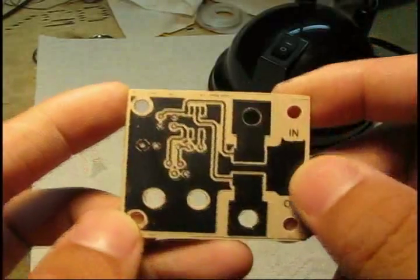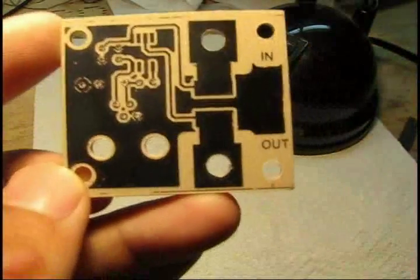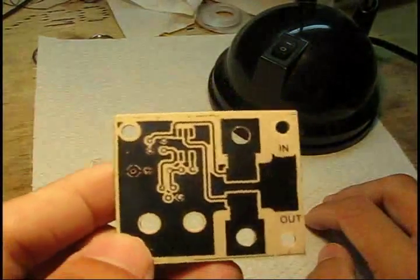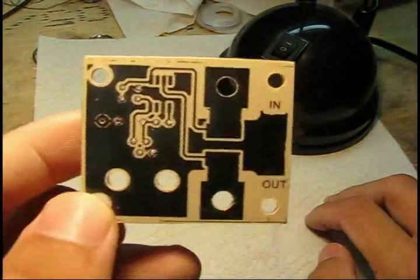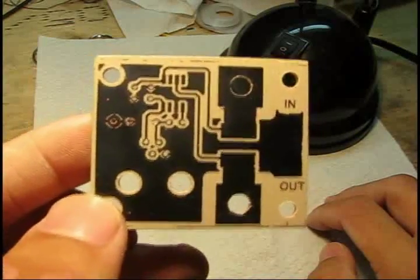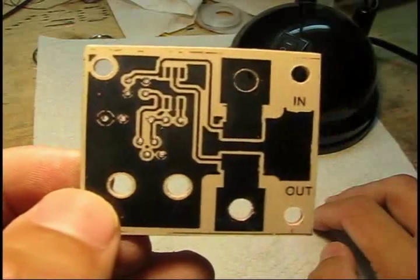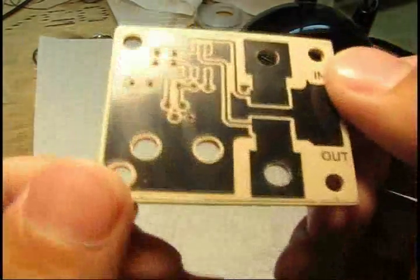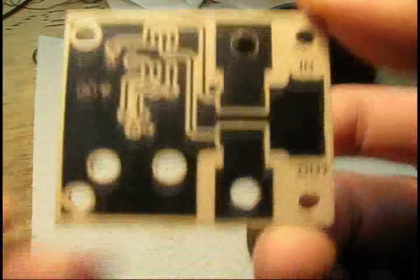If you get the materials, you can start building your own circuit boards. The larger circuit boards start to cost a lot of money. Some disadvantages of this method: it's trickier to do double-sided and it's impossible to do four-layer boards. But for single-layer and some dual-layer designs, it's going to be much cheaper than any manufacturing house. However, you won't get solder mask and silkscreen on your board, so you'll need to print out your component values and carefully populate your board — but it's still cheaper.